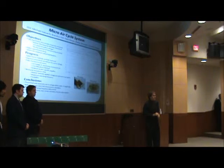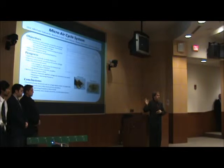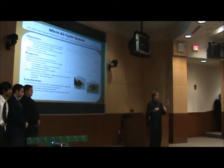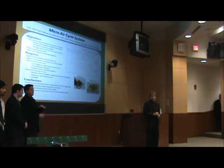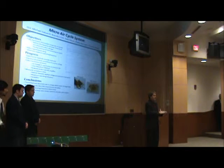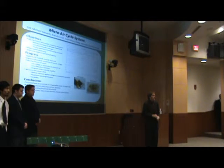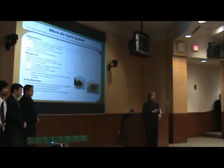The application: this is a micro air cycle system that actually traps a bit of air if we can get a seal, then compresses it to heat it up, and passes it through a thermal heat exchanger. When you re-expand, that amplifies the cooling effect because it's called the reverse Brayton cycle. It would cool air, and it's scalable — you can have stacks of our device to cool anything from a small chip to a human body. Last semester we actually calculated the coefficient of performance and it stacks up quite effectively compared to traditional systems that use chemicals and other approaches.